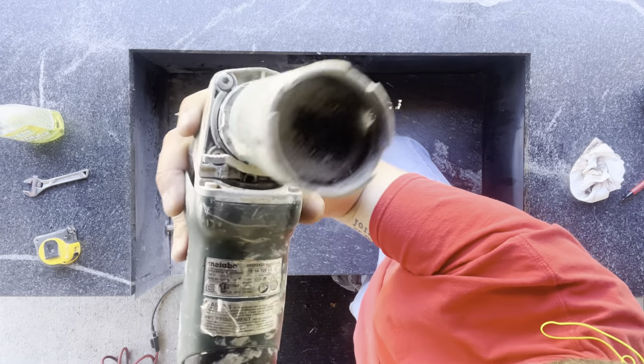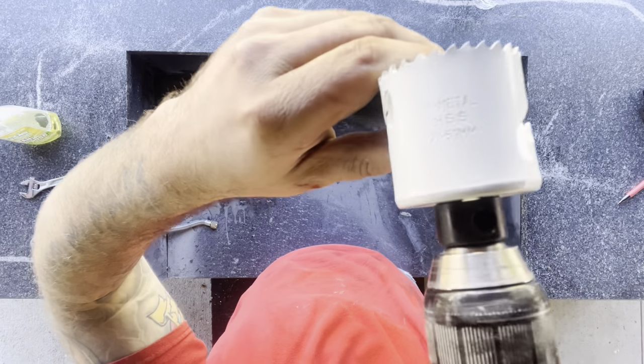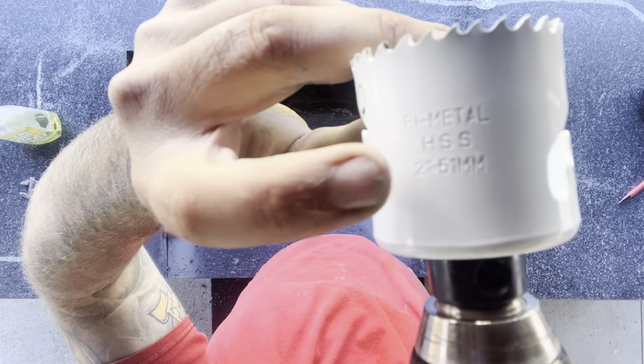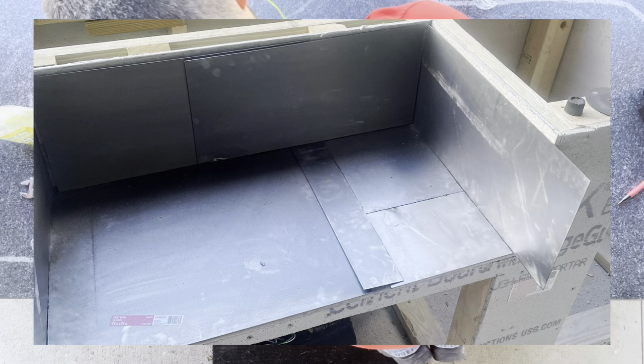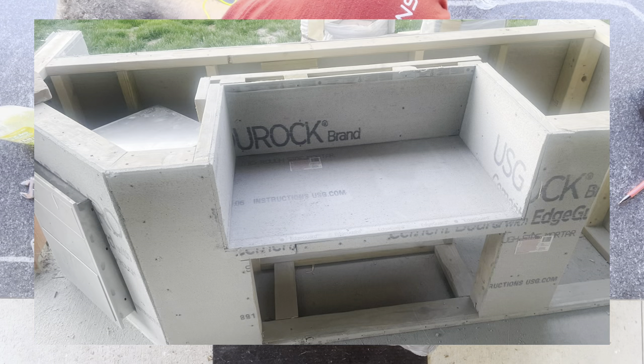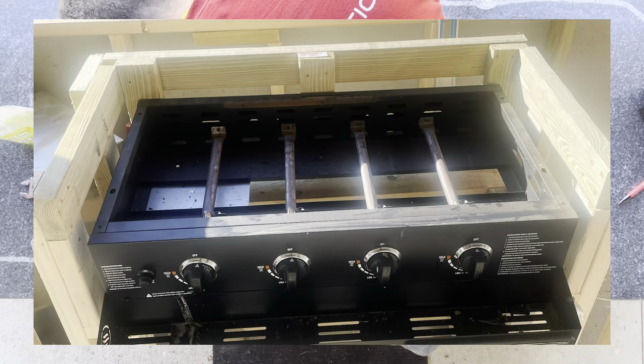So there's that core bit — put the core in it. Now what we're going to do is drill through the backer — a stainless backer that I put in there first to help with heat dissipation when I was building this unit. There's also a welding blanket in under there, which is not a huge deal to drill through — it's just wool with copper mesh fiber woven into it for heat dissipation. And then the last layer is going to be Durock, again for heat dissipation and to keep the heat away from the 2x4 construction of my island.